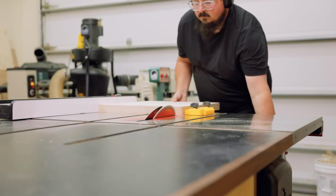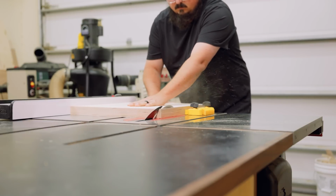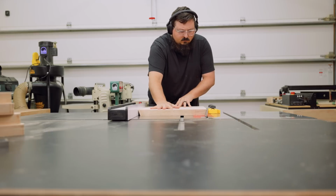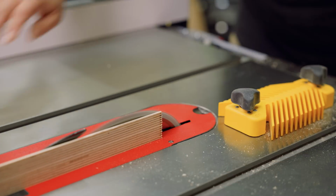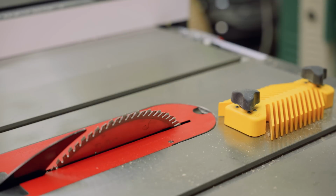So back over at the table saw, I could go ahead and cut in the bevels for the armrest into the sides of the seat. I decided to start with the sides because doing so allows me to have a square reference edge to work off of for the remaining parts. There are quite a few tricky compound miters within this design, so referential measuring is pretty pivotal for success, and I'll explain more about that throughout the next couple steps.